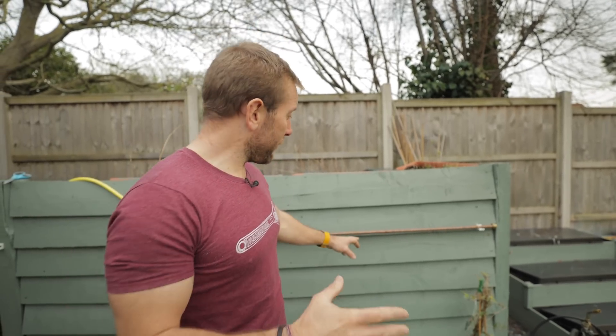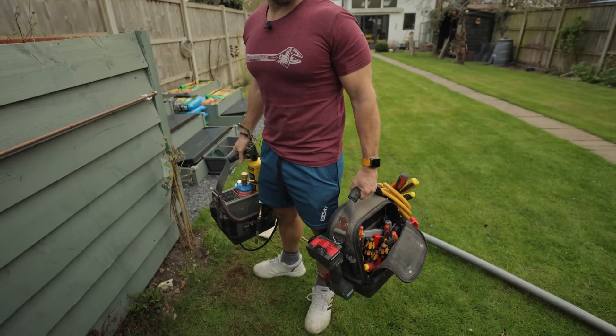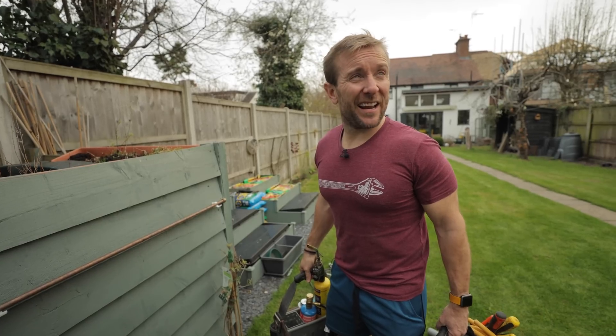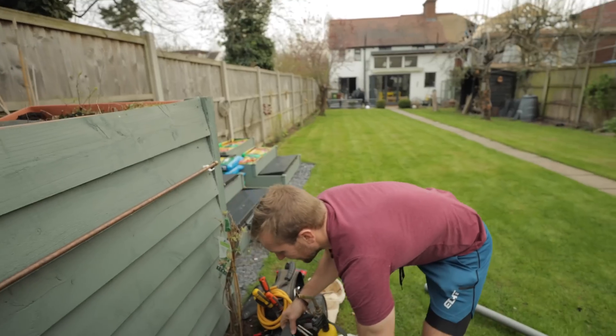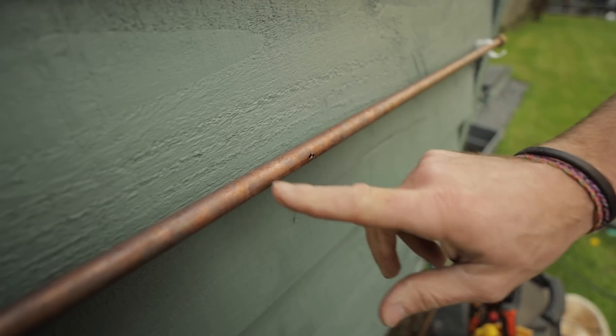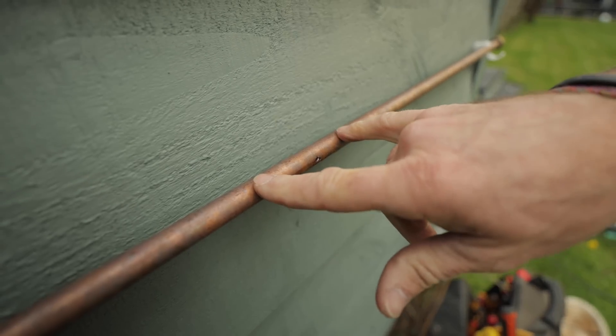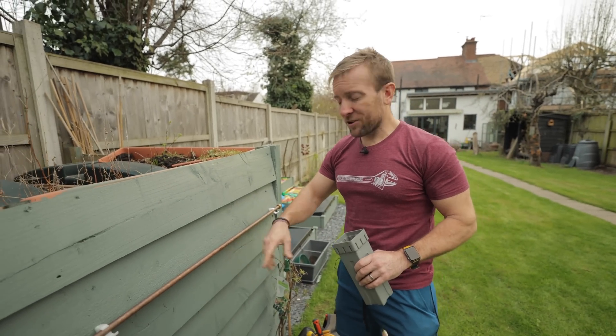If you know what to do, you can now do a very quick fix on this pipe here, using tools you can get from our Amazon store. You need to ascertain where the leak is. Usually on splits in pipe, the splits are about an inch long, and you're looking to cut out two sections of pipe and put two couplings in, then join it through. Sometimes you'll be lucky and have a pinhole type failure, like what we've got here, which I certainly didn't drill.